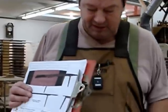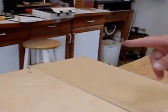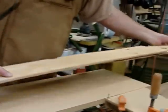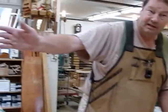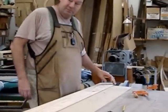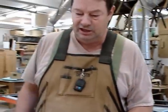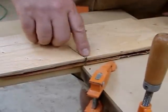So what we're doing is using a slightly different method here, and it's a simple method. It consists of three nails. One nail is located right there. Then a beam — a beam we've made out of two straight sticks that are stapled together. This beam touches that nail and touches the center nail here. That nail is offset the proper amount, and the beam is nailed up to match that offset. You take your pencil and hold it where the two straight legs of the beam meet together.